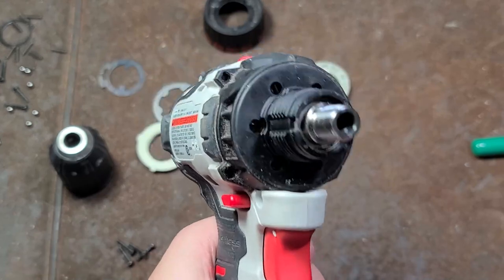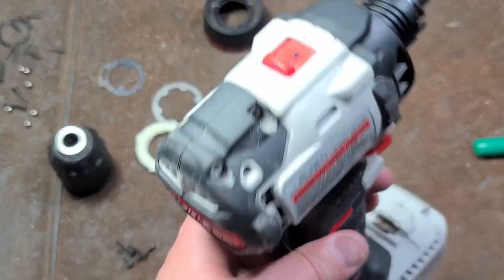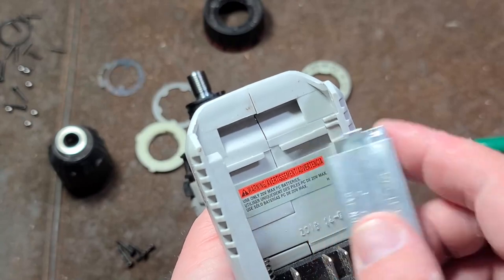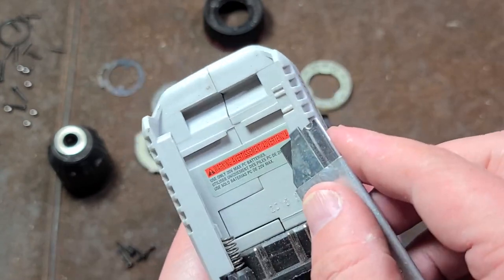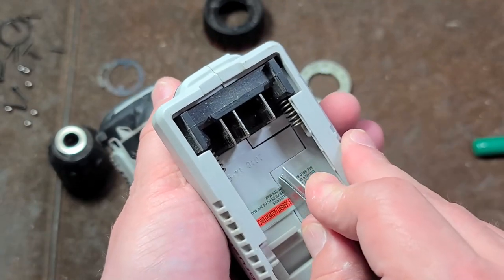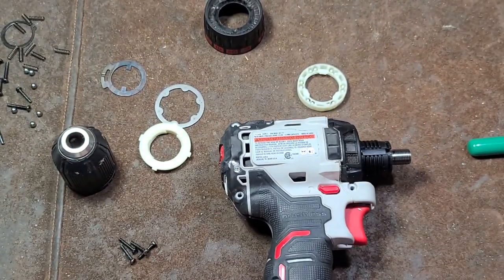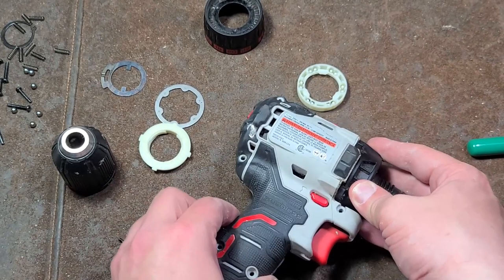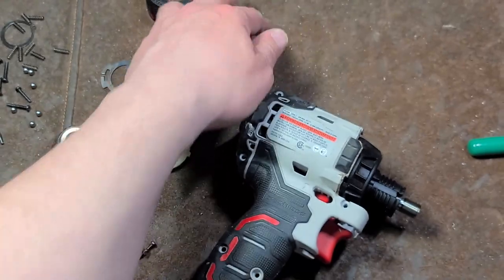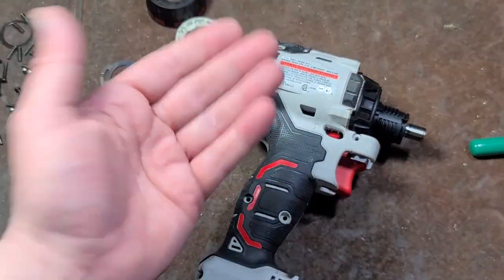That's how they eliminate the brushes and keep power density high — using a permanent magnet motor — but they have to have electronics to turn on and off those coils. The problem is, on low-speed applications, it can't really tell what position the motor's in and may buzz and jam. So they have to put in magnetic sensors to tell exactly what position the motor's in, so the controller knows when going slow which coils to turn on. Drone motors don't ever operate at low speed — they always operate at high speed — so drones save power and weight by having non-sensored brushless motors.